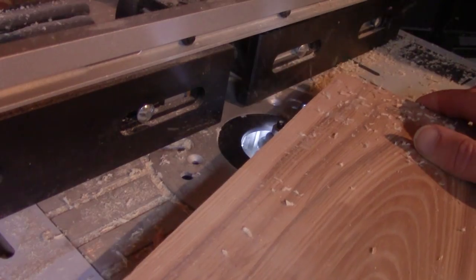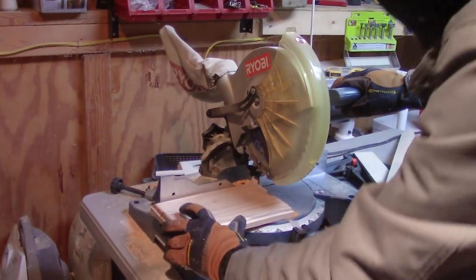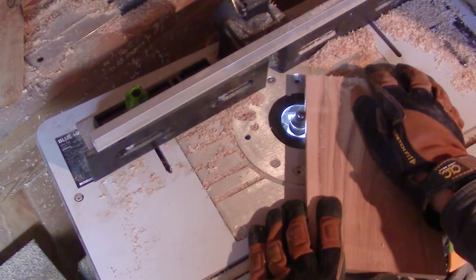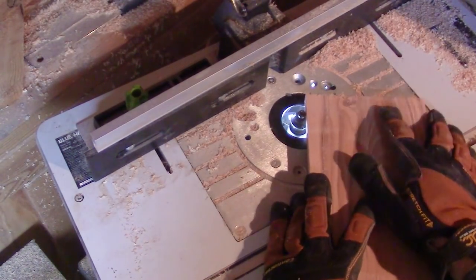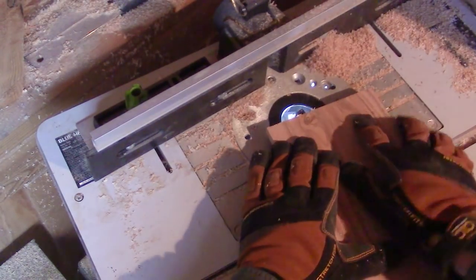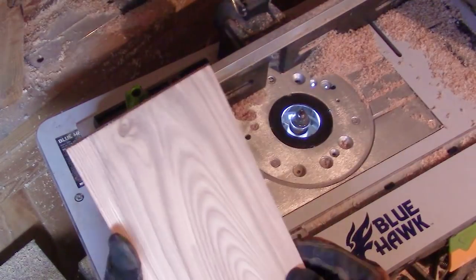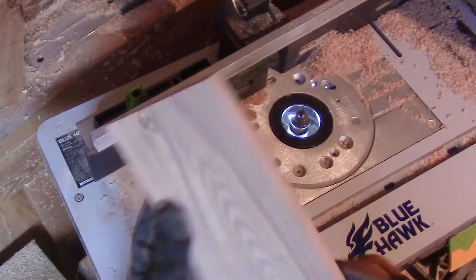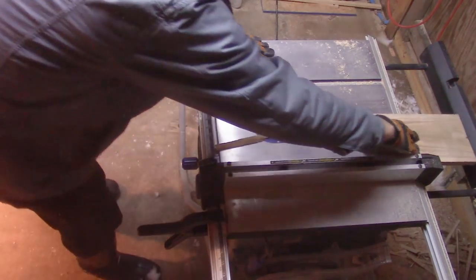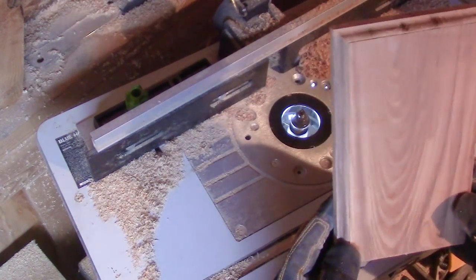Things were going okay, but then the bit started to move. Obviously I didn't tighten it enough, so I took it out, retightened it, chopped off the messed-up edge of the board, and tried it again. It didn't take too long to get some confidence. It's a fairly simple tool, but it can do some massive damage if something goes wrong. I was pretty pleased with the routing job — but I realized I did it on what I wanted to be the back. So I chopped off all the routing I just did, making the board even smaller, and routed it again. It came out good, but it was much smaller than I was planning.